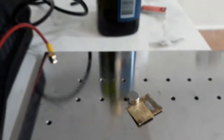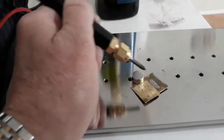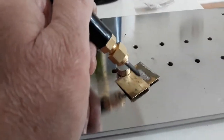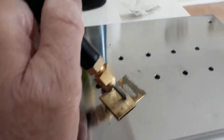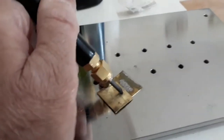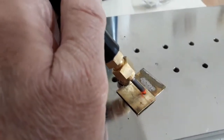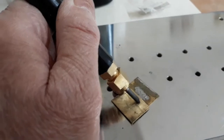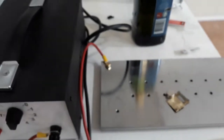And that's soldered that together. What it allows me to do is use these magnets to hold the pieces together — put them on while it's cold, hold the parts together, press it down, turn it off so the solder cools down, and then take it off. That's one of the things you can do with it.